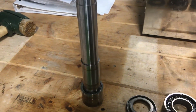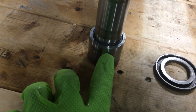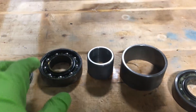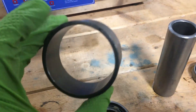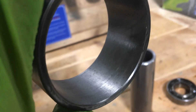All right, so you have the spindle apart, looks good. I cleaned it up some. All of this is some fretting and corrosion on the bearing face — not going to worry too much about that. The inner race looks good, pretty consistent wear going around. I cleaned up these two — I gotta mic this to make sure they're the same height. I do have some rust over here as well as some rust on the inner side of this spacer — little dots, you can see there.